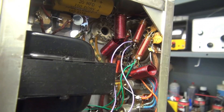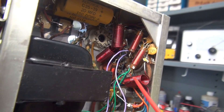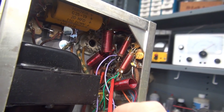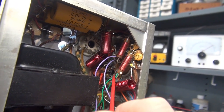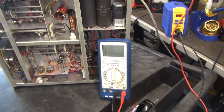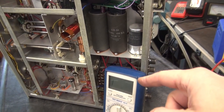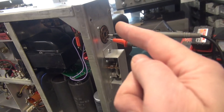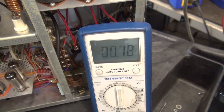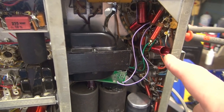The wiring is complete. You have to work in this hole — it's not easy, but just take your time and pay very close attention to the numbers on that socket. Pin 8 is over there, 7 is towards you, then 6, 5, 4, and so on. Don't get that reversed or you'll have a fireworks show. At this point, check and double-check your connections. I'm going to take my ohmmeter and go across the contacts to make sure they line up. I'm on pins 8 and 1 right now, and when I flip the transmit switch the ohmmeter confirms I'm good to go. I'll do the same for pins 3 and 4, and I can physically see the filament lines going to pin 7.